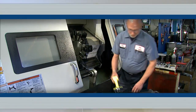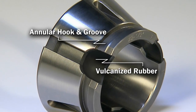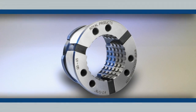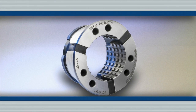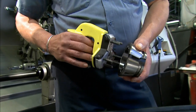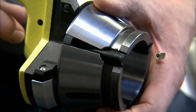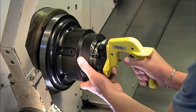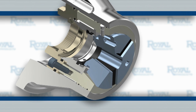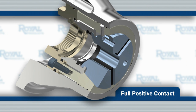Here's how it works. The collets are made of hardened steel segments that are securely joined by vulcanized rubber and feature an annular hook and groove configuration. Holes in the collet face align with steel pins on the installation tool. When the pins engage the collet and the trigger on the installation tool is pulled, the collet compresses and easily fits into the collet chuck. When the collet is inserted to full depth and the hooks are aligned, a quick release springs the collet open, seating the hooks for full positive contact.